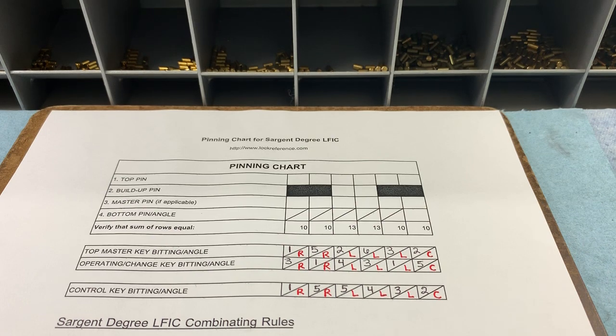The article covers all the nuances between them, but basically DG1 uses conical pins, while DG2 and DG3 use angled bottom pins. As it relates to a pinning chart, that's the main difference between them — same formulas, same math, they all pin up in the same way. What I'm going to show today is DG2 or DG3 because I've got angles, but the same approach, formulas, and math can be used for DG1 if that's what you've got.